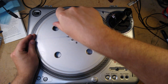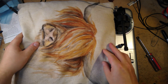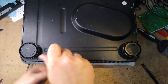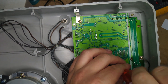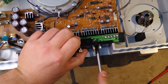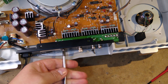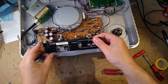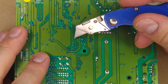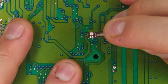To dismantle a PDX, remove the platter first to avoid damaging the spindle. Put a cushion down, then put the turntable upside down on top of it. Remove the 14 screws on the bottom plate. Find the main PCB, detach all the cables, remove its screws, and remove it from the case. You'll also have to remove the rear plate — to access its screws, detach the input board from it by unscrewing the rear screws. Before doing anything else, cut the trace underneath the board to disconnect pin 1 of the microcontroller from VCC, as required by the new chip — make sure it's completely detached.